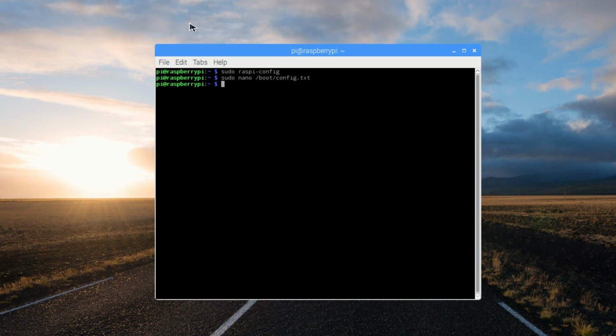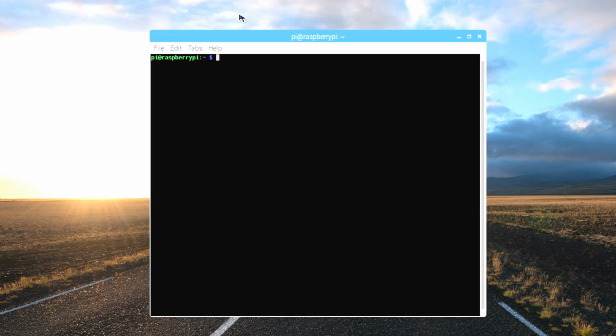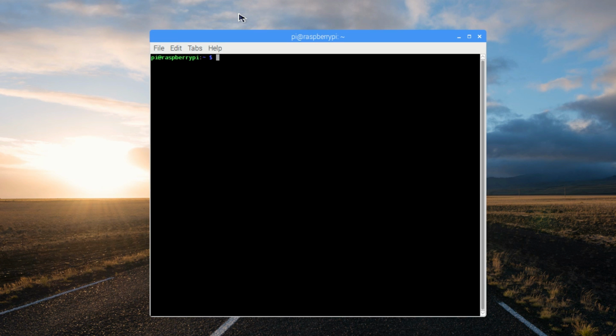Before we do anything else, we have to reboot for these changes to take effect. So use sudo reboot. Once the Pi has rebooted, change directories into our code folder, cd gpio_python_code, and create a new program. We'll use the shortcut to create it using nano 7_temperature.py.